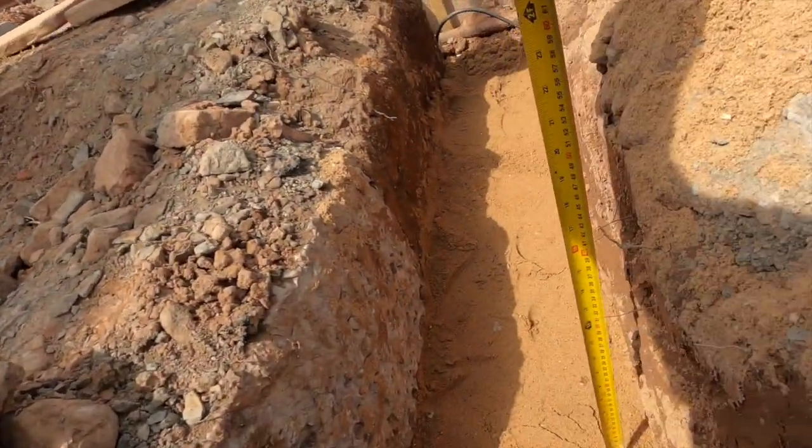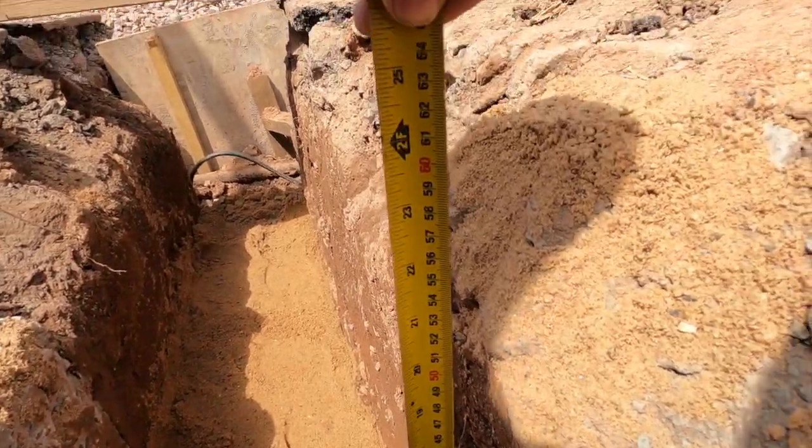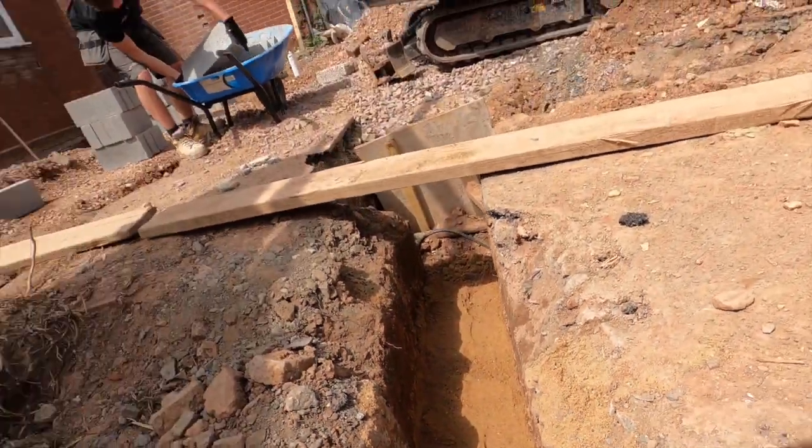So at the minimum, for the gas, which is the one that's normally on the top, it has to be 450 mil from the finished floor. So this, the highest part we've got of this blinding now. You see that? That's 600 basically is where our highest point is, and then down here, because it tails off a little bit, it goes to about 800 now.